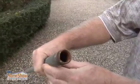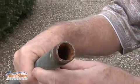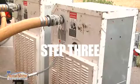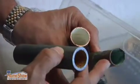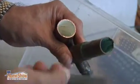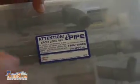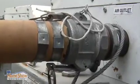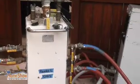That's what the pipes look like. In certain sections of our house, we had actually yellow rusty water. Finally, the pipes are coated with an epoxy lining which seals all the leaks. Once we have the epoxy coated and we've initiated the initial cure, on the third day we'll come in and start putting back the angle stop valves and the supply tubes. We use all new supply lines as well as angle stops. Then the system is actually pressure tested to make sure that we don't have any pinhole leaks at all.